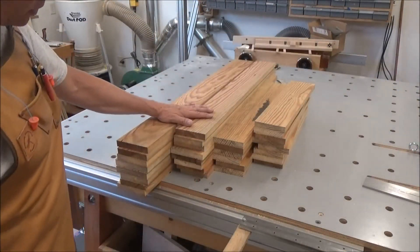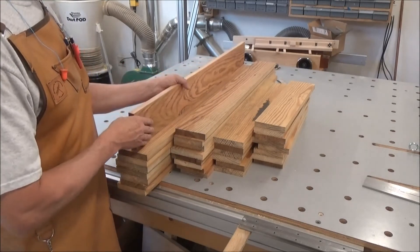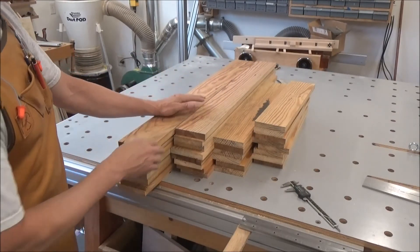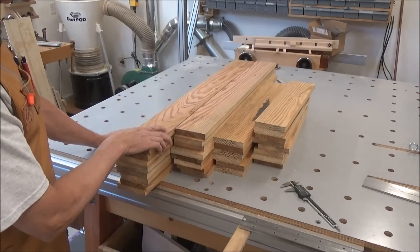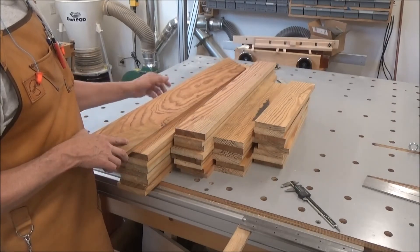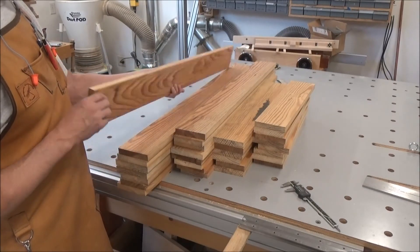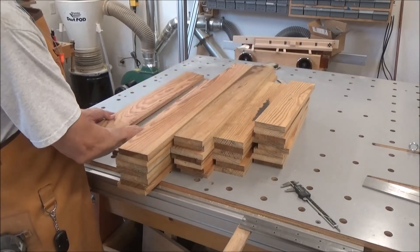Out of this I've got to get five shelves. They're surface planed on both sides to just a bit over three quarters — about 20 thousandths over three quarters — so that gives me something I can sand, and they're all uniform thickness. I wanted to stay three quarters or better, which I did. After planing both sides, I jointed one edge. I wasn't concerned about them being parallel at this point; I just wanted straight and a good glue joint. One side went toward the fence, then the opposite side, so when I glue this up it'll be grain up and grain down — alternating.